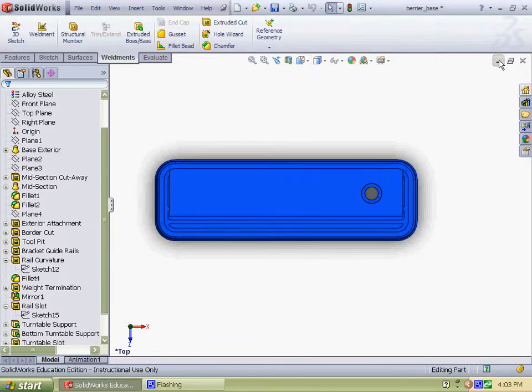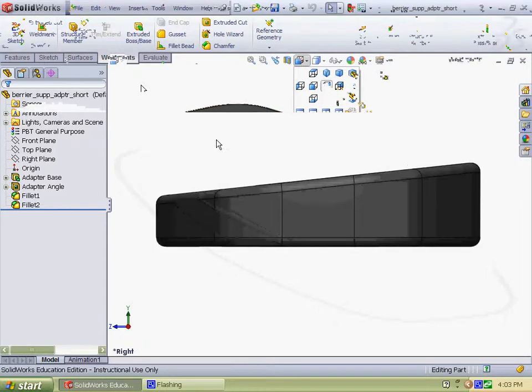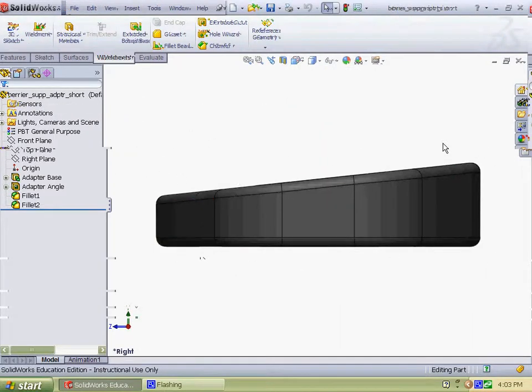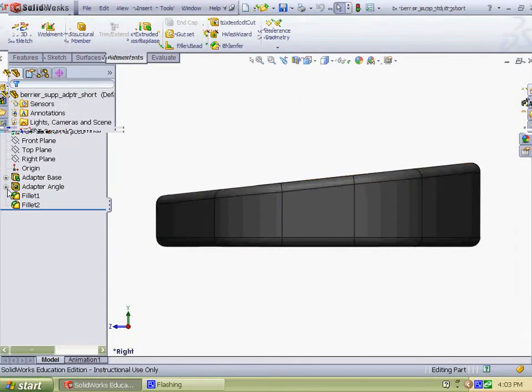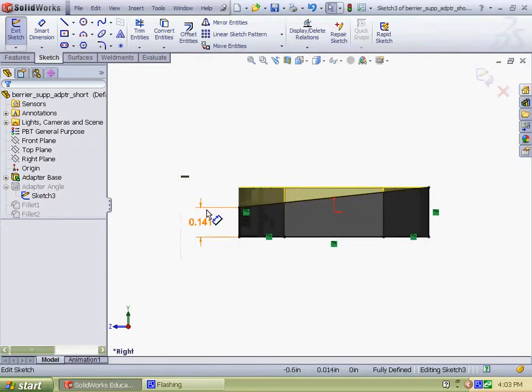In addition, I used on-edge sketch relationships. Here I wanted to make an angle cut from an original rectangle. Instead of making a lot of lines and doing a lot of dimensioning with that, I just used on-edge relationships, and all I needed was one dimension in order to make this cut, which literally took 15 seconds.